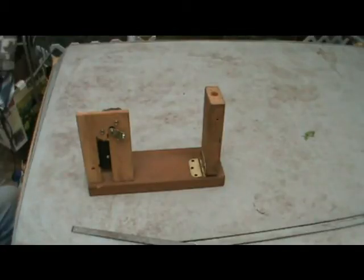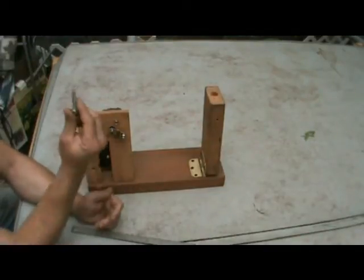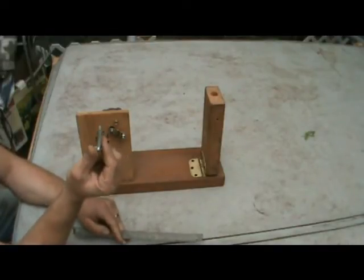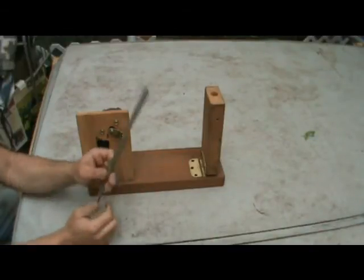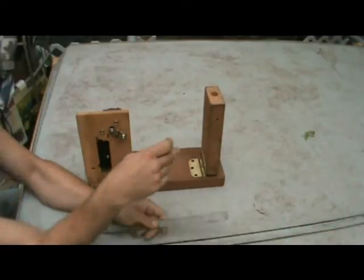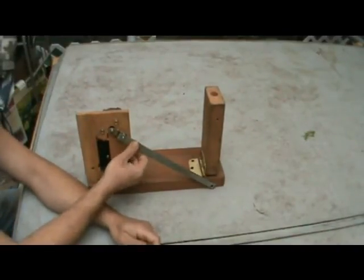This one is 1 3/4 inches. You could easily go with just 1 inch. But again, I'm using what I've got on hand. Whatever diameter, I wouldn't go any smaller than 3/16. This is bigger. So in my case, I have two different size holes in my metal bar. One sized for the crank, one sized for that. Easiest end usually to mount first is the crank end.